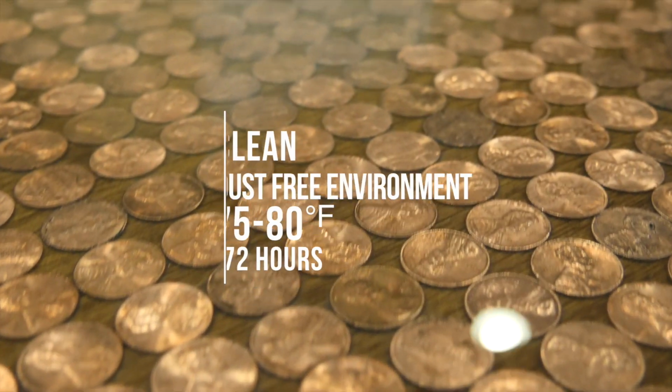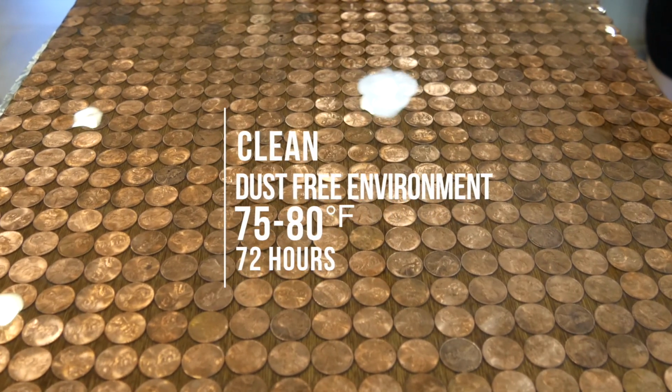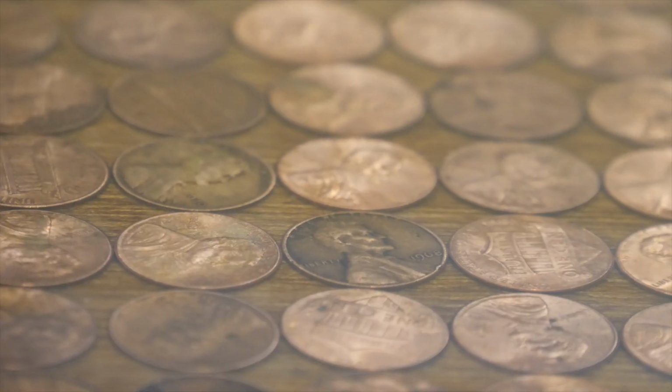Keep your project in a clean, dust-free environment at a minimum of 75 to 80 degrees Fahrenheit for 72 hours to complete its full curing process.